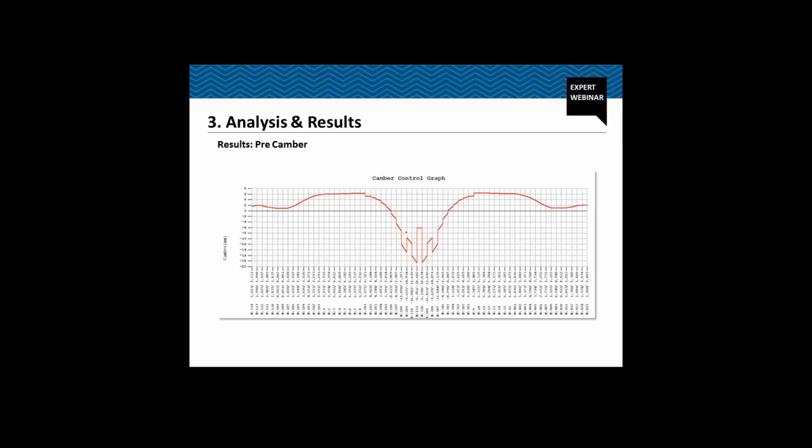Now why is it happening? Because of the self weight of the structure, in this zone the structure will sag and have some vertical downward deflection. And similarly, because of the SIDL, we again have some downward deflection. But then we have pre-stressing at the bottom fiber, which will cause the structure to hog up. So effectively, in this particular case, we are having overall upward deflection due to dead load, SIDL, and pre-stressing. Now the effect of the creep will be to take this upward deflection further upward.